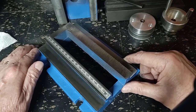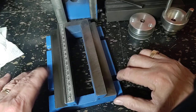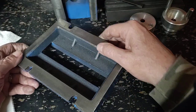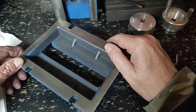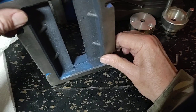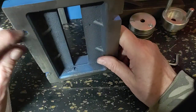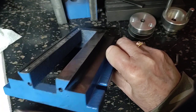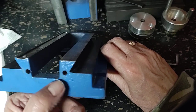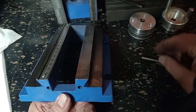This is actually the bearing surface here. They put a little scale on it - in millimeters I guess - so you can do your precision reading right here with the non-vernier sort of scale. This is actually going to be one of the shorter videos in the series. I just wanted to get you down to this stage and see what was here. There's a lot of filing and smoothing coming my way. At least they broke the edges here - not a bad casting. There will be a lot of paint removed.